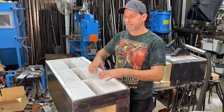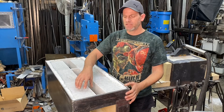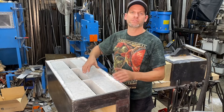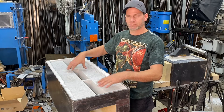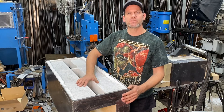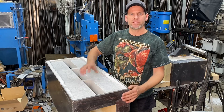We're putting them all together and installing them into this Monster Forge. Making a forge this size takes a long time because we have this cement refractory that we have to wait for it to cure. Every piece that we do we have to wait for it to cure, pour it, wait again, and this could take several days. This top piece actually took about three days to pour, and then our ribbon burners took another few more days, and then we had to preheat them and get them up to temperature to cure them.